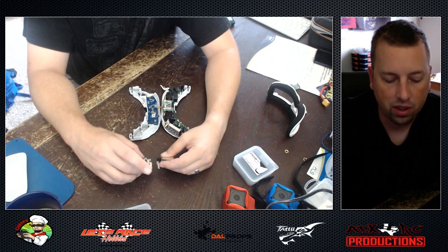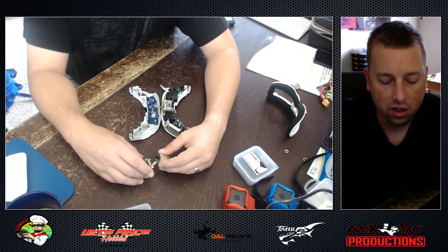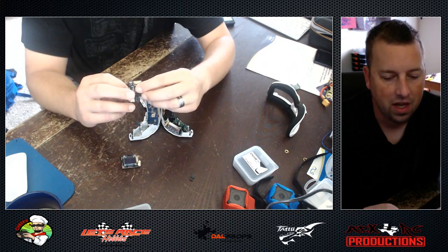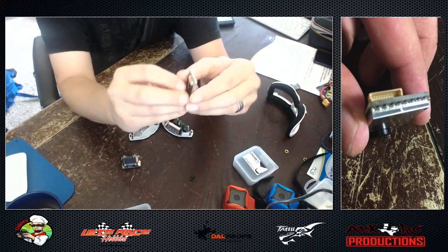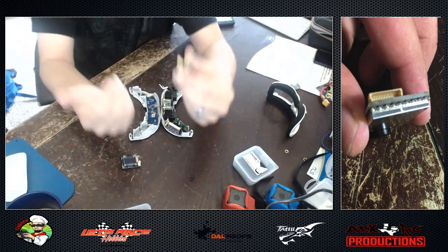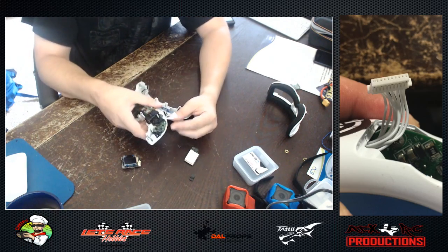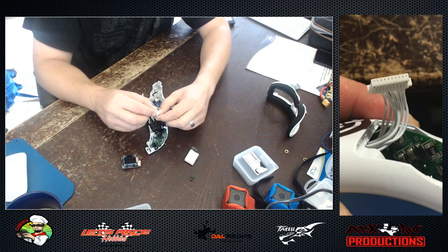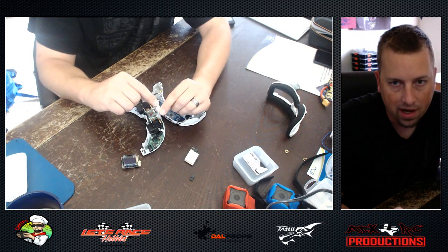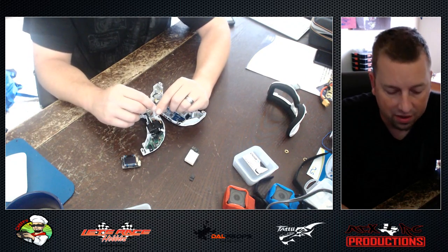I messaged Bruce and he got back to me extremely quickly and said, 'Dude, you've got a bent pin — check it out. If you can't figure it out, give Ivy a hit up.' So I took a look and sure enough — you're not really going to be able to see this, but on this side of the diversity module, on this connector, two of the pins were basically touching. The easiest way to notice this is to look at the connector pins. One of mine looked like it was smashed closed and the one right next to it looked bigger than all the rest — a perfect sign something was wrong.